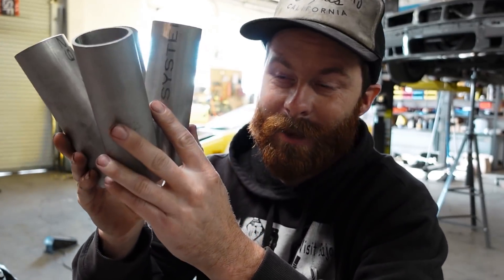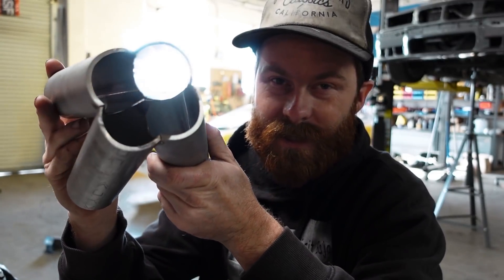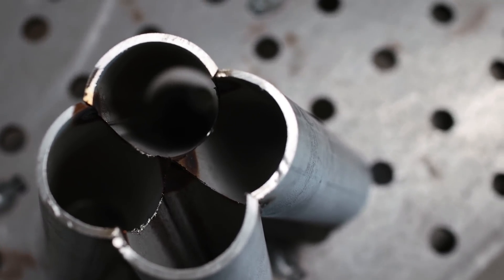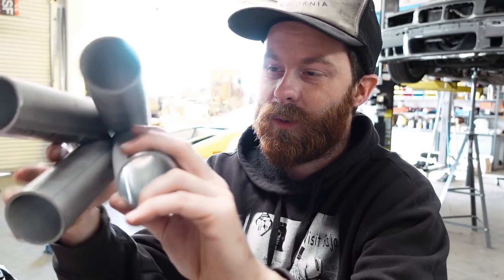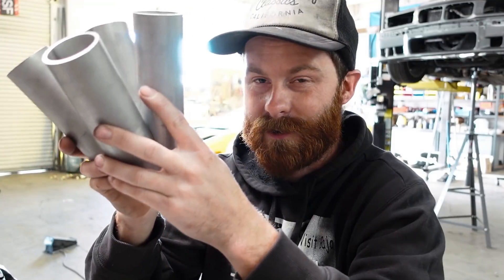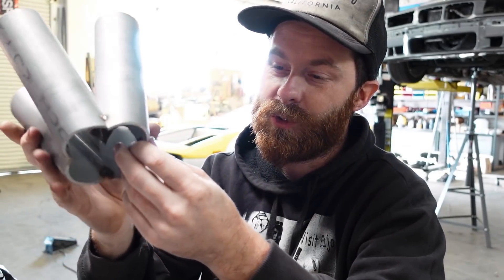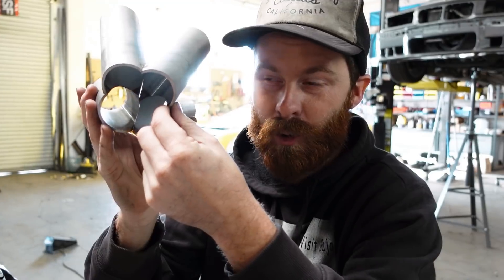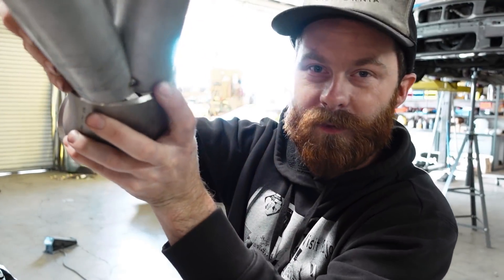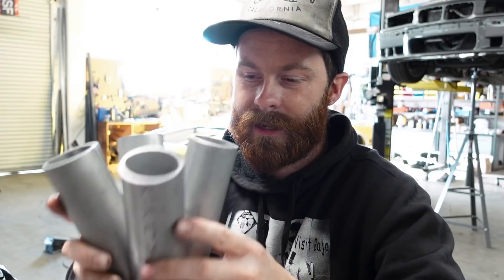I remade this one at 72.5 degrees and it looks a lot better. It's going to be a lot harder to weld — I don't exactly know how I'm going to do it yet, but I'm going to give it a try. Overall it came out really nice, very well met up in the middle with only maybe a 32nd-of-an-inch gap. We will have to cut these legs down a bit — they are too long — but I'm not going to cut this up again. So let's weld this thing up, then heat it up and push the inner corners out so it successfully mates up to the diameter we need.